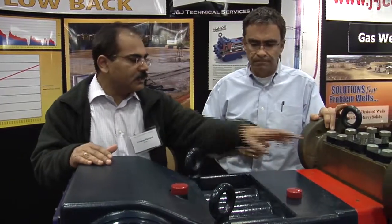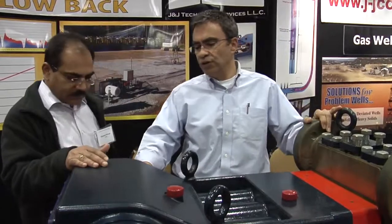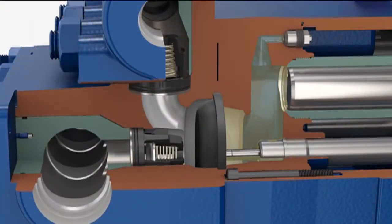The fluid is in contact with just the top of the diaphragm. The diaphragm is powered hydraulically — the same fluid that lubricates the bearings drives the diaphragm, but they're not connected mechanically. The diaphragm is completely separate — it's a balanced diaphragm type of pump.